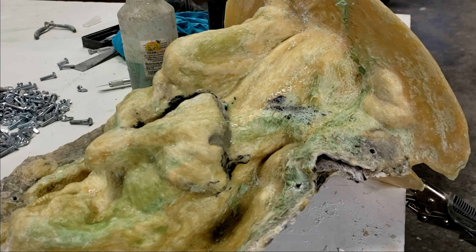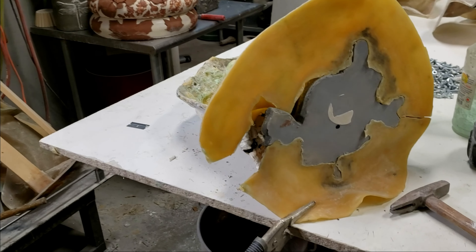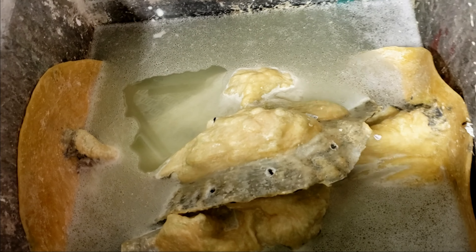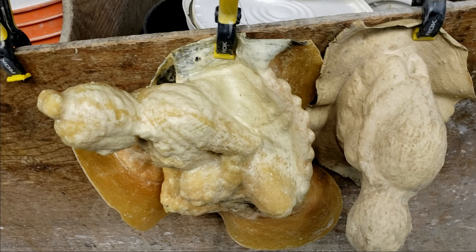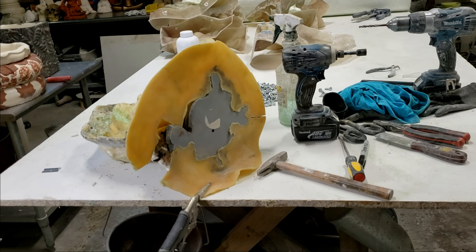As I mentioned, pulling it off for the first time when you go to strip it can be a real pain depending on the material it's on — it can be a tough pull. Nobody needs to see me do that because I'll use really nasty language, and it takes a long time — sometimes you're fighting with a piece for half an hour or 40 minutes. Once you've got the rubber off your model, I just drop it down into the sink with some soapy water and a little dish soap, then hang them up to dry. You're washing to get rid of residue from the wax, residue from fiberglassing, some PVA — it just gets it all off.